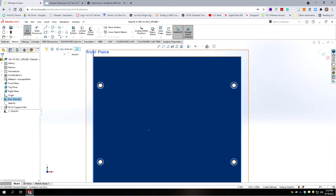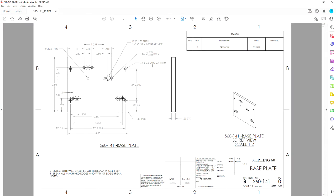We're going to go back to our drawing and decide which is the next hole callout we're going to use. Let's do the 6-place dimension for the 1/8 inch slip fit pinholes. The reason being is the dimensions for that also provide the location for the clearance holes for the bolts. So we want to make sure that those are placed correctly. So we'll just do them in order of operation because the dimension calls out the smooth hole, and then the location of the bolt hole is taken from it. So we have 6 places, 1, 2, 3, 4, 5, 6.